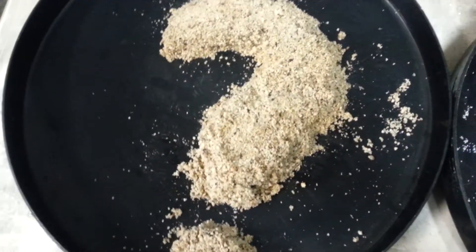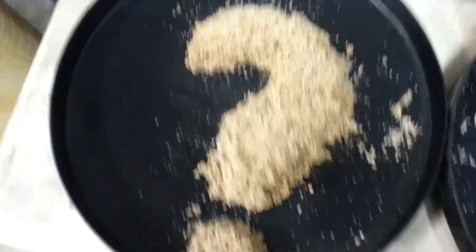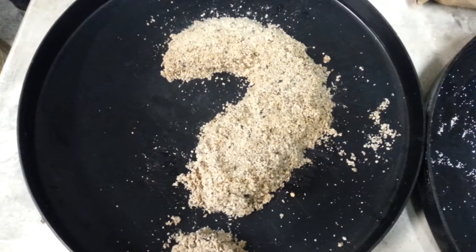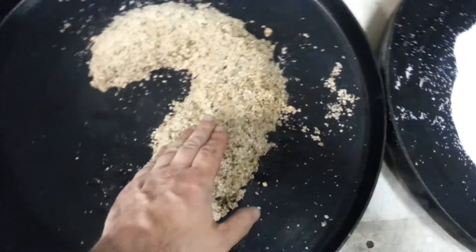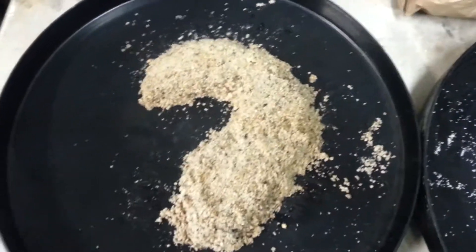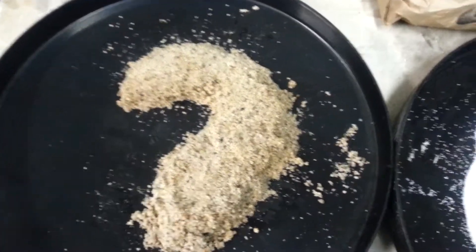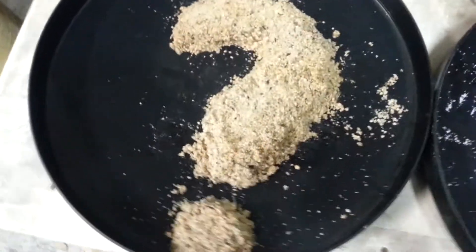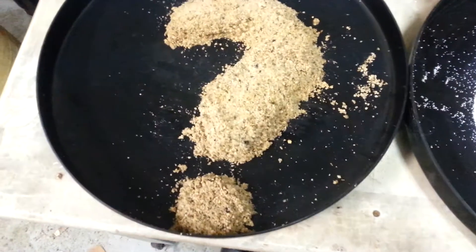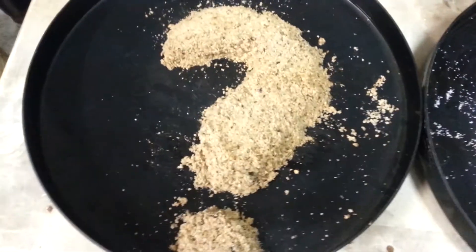This customer was having trouble getting their pH raised even though they had a full tank of, quote, calcite in their system. It wasn't working because it's this garbage that doesn't work. The tank was about 10 years old. If every year you add more stuff to it and 20% of that is non-reactive, eventually you have almost a whole tank full of stuff that isn't going to do anything for you.